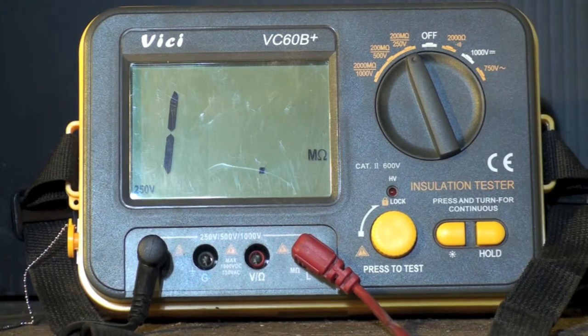This side here shows voltage and other things you can use it for, but the primary thing you're checking with this meter is the windings of some kind of motor — to see if, when I put a high voltage to them, it shows continuity to ground. That's unacceptable.